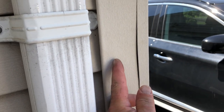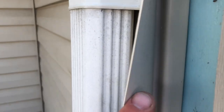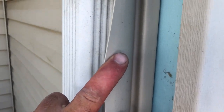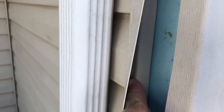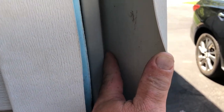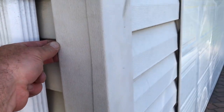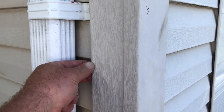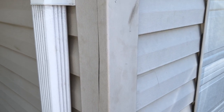What I'm going to do is from the inside, cut with the utility knife — I'm going to go way inside where my finger is at the very edge — and just take a utility knife and go all the way down from the top to the bottom. I'll do that cut on both sides. I'm going to go inside as far as I can reach, cut the extreme edge all the way down, remove this piece, and I'll be left with the outside portion of the J-channel, which I'll use to put the new outside corner on after I show you the modifications.